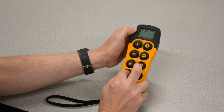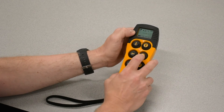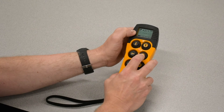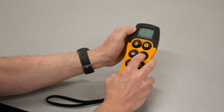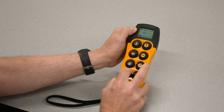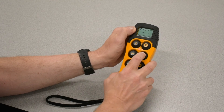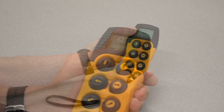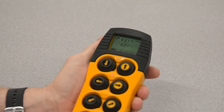Once there, select F1 and we're ready to add the input. For the first digit, in the first dash position, press the trolley right key, scrolling to 4, locking the digit with F1. Second digit to a 2, locked with F1. Third digit to a 1, locked with F1.